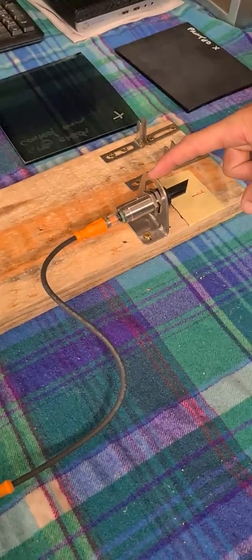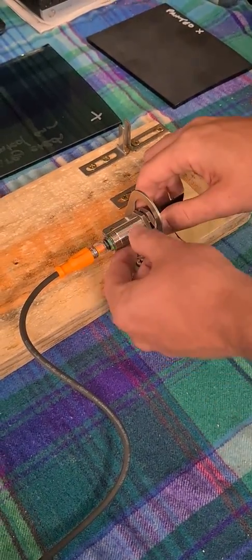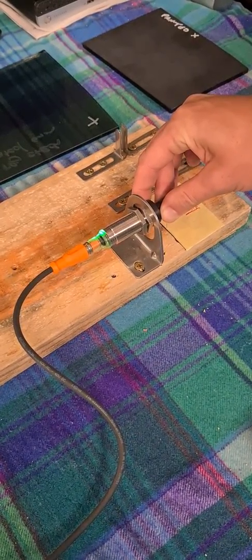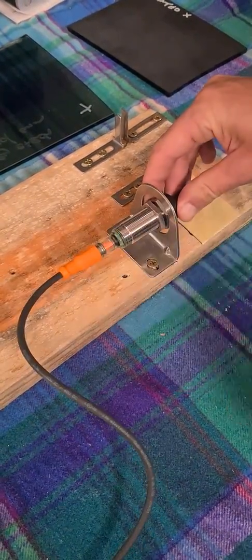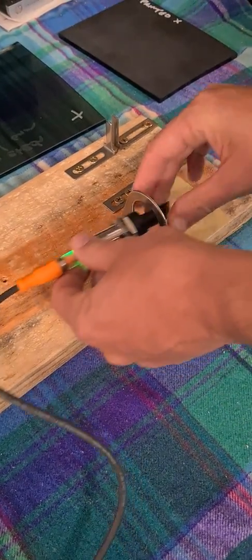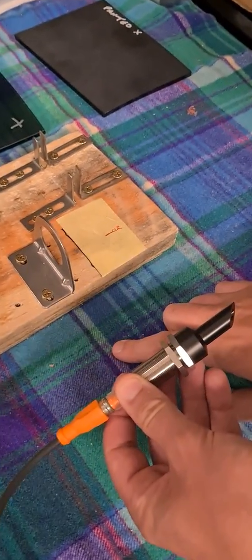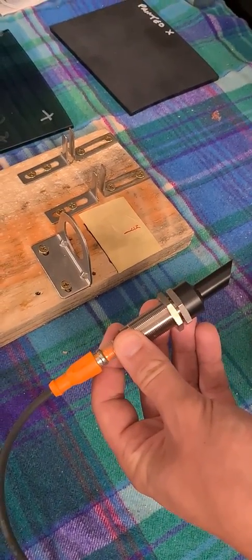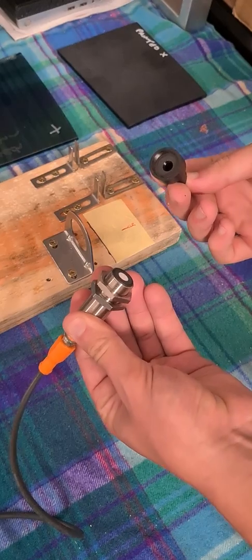The competitor sensor we're trying to replace here was a 30mm body. To get accurate switching we need to accurately mount the instrument, so we need a bush to locate it for repeatable placement — so it can be removed and reinstalled into exactly the same location. To accommodate the sound tube length, we've had to recess the sensor mounting location by 28mm. There is opportunity to trim the sound tube, but that's not shown officially in any documentation. The sound tube is a removable part purchased separately.